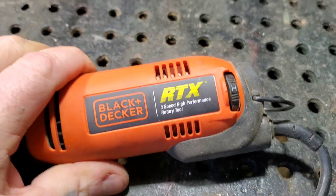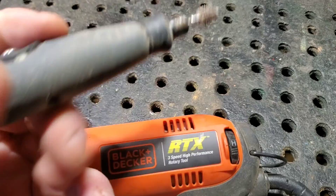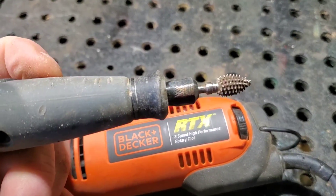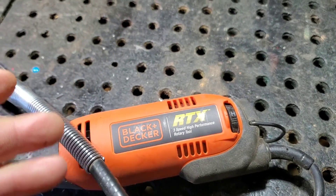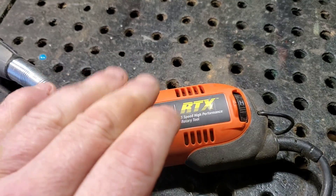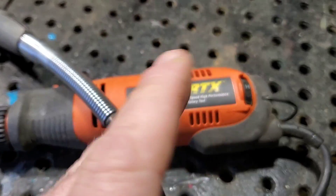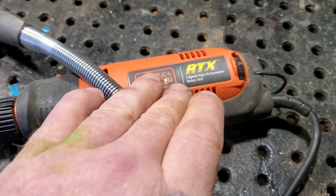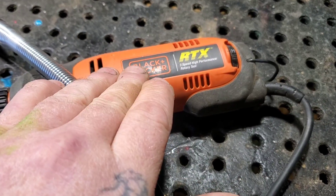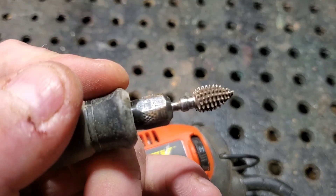When you're using a foot pedal, since this RTX already has a variable speed inside it, you should keep the RTX set to high and control your speed entirely with the foot pedal. You don't want those two variable speeds crossing each other, because if they do you might risk wrecking the tool. Just leave the RTX on high and watch how slow you can run it with the foot pedal alone.